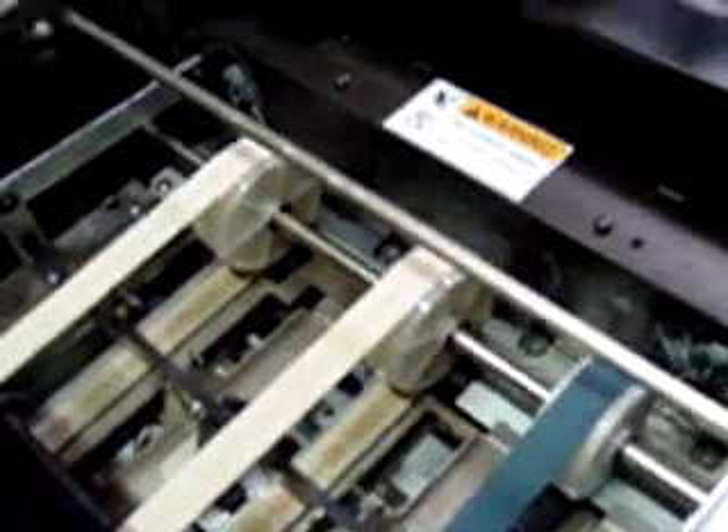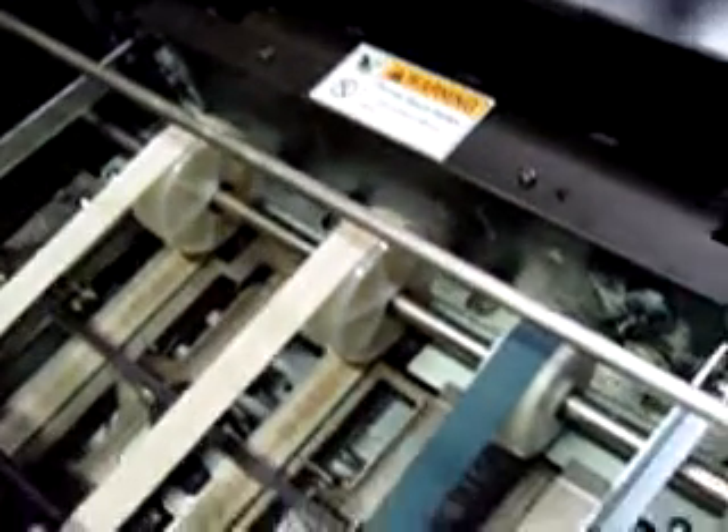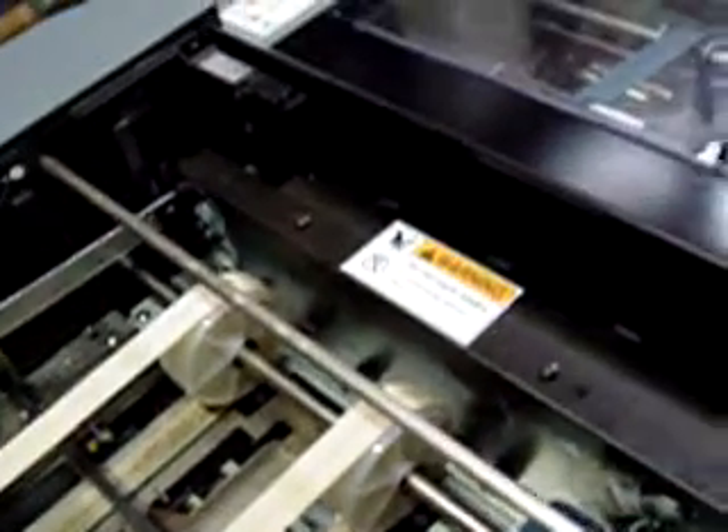When cleaning in here, you want to take very, very great caution. Usually the trimmer blade is down; sometimes it might be up. You want to be very cautious around that blade — it is very dangerous. Whoever is going to change out that blade needs to have a lot of knowledge on how to work on trimmers, not just guillotine cutters — trimmer blades specifically. You have two blades; they're both matched to each other and both have to be changed at the same time, and both have to be set absolutely right. Otherwise a $600–$700 set of blades is just gone in one pull.